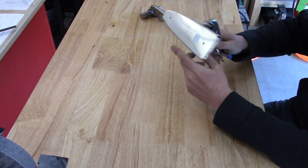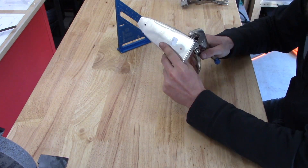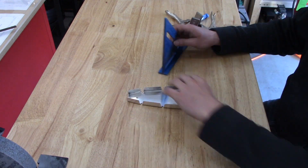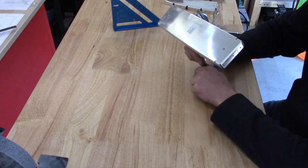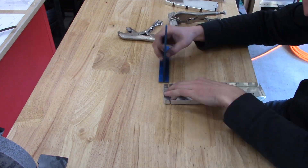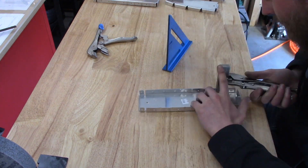Starting up right where we left off from the last episode, I am finishing the seaming and fluting. That jig isn't able to reach the flanges in the nose of each rib, so those still have to be done manually. I double checked that all the flanges were the proper angle and made small adjustments where required. I got fairly fortunate — a majority of my ribs were fairly straight, so they did not require a large amount of adjustment.